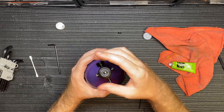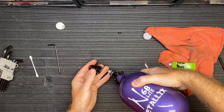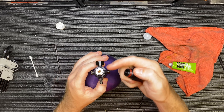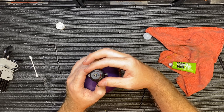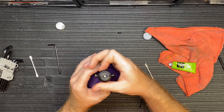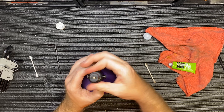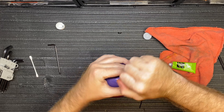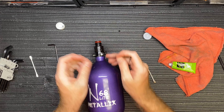Aim the bottle directly up and down — if you try to do it sideways the pin wants to fall to the side. Some people try to do it upside down but everything falls out that way, and doing it sideways causes it to bind inside. Hold it vertically, take your bonnet, and drop it right down on top — everything will line itself up. If it doesn't line up correctly the pin won't come through the hole, but now you can see clearly the pin is coming through perfect. Hand tighten it up and don't forget the set screws on the side.